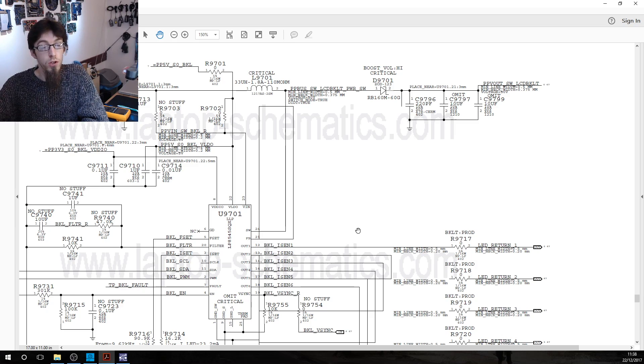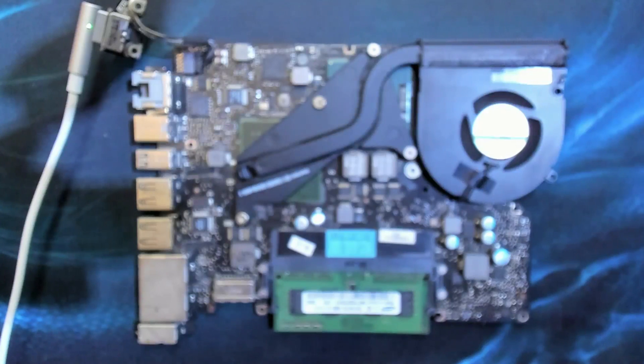Those are the two usual suspects: a missing enable circuit or faulty device, or a broken feedback line. That's where you start if it's not as simple as a blown fuse. In summary, in this episode we've learned how to replace a broken backlight fuse, seen its effect on the circuit, and covered where to start if it's not just a blown fuse. Leave any questions in the comments below, and I'll see you in the next episode. Thank you very much.